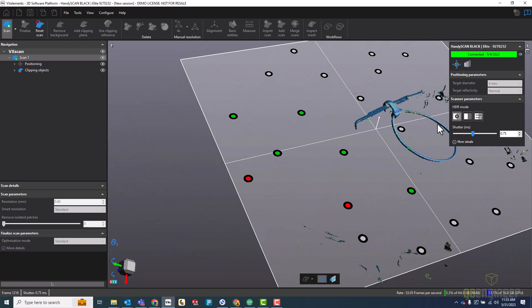For direction, I want to go up to this surface, and I think we also need to extend it down up to this surface. My thickness is going to be 1.6. There we go. Now it should merge the results, but it should only merge up there because it's not actually touching down here. So that's exactly what I want — when I put the tweezers in here, this whole part should flex outwards and then snap back, holding the tweezers in place.